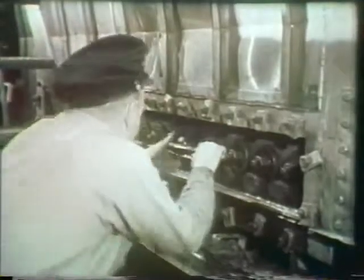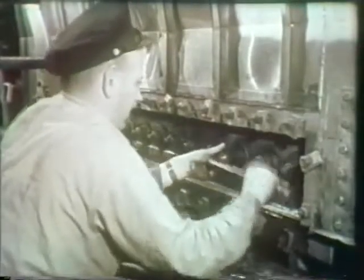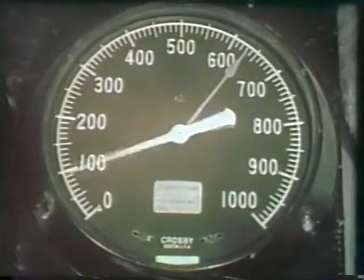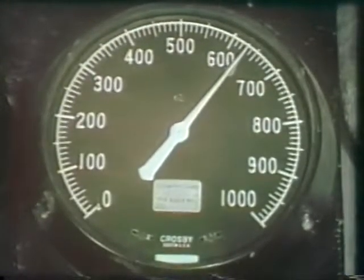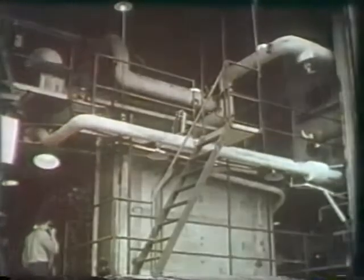When all leaking gaskets have been adjusted, set up the plates firmly using a handhole or manhole plate wrench, especially designed for the job. The successful hydrostatic test proves that the boiler has been properly closed and is ready to be put back in service.